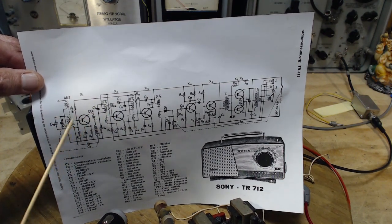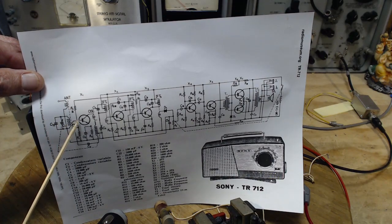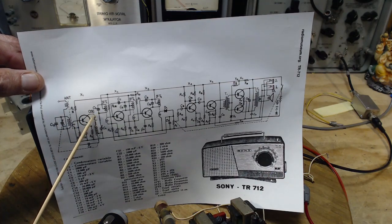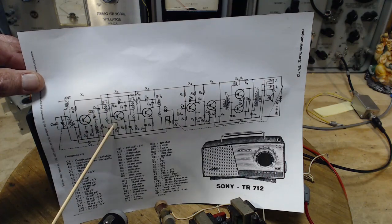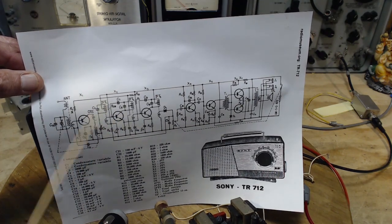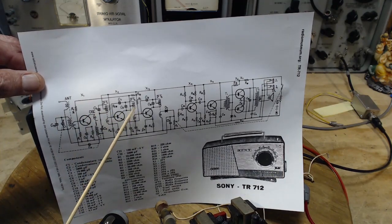Well, that's what's going on. Anyway, we should be able to pick up a radio signal here at the broadcast frequency. Should be able to pick up the local oscillator frequency in here, but if you fool with any of this, like if I stick an instrument on any of this, it'll probably throw it way off. It'll just unbalance everything. When we get out here, though, it's a little different.